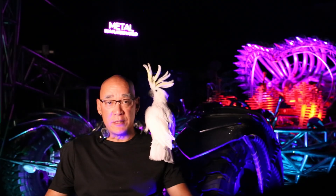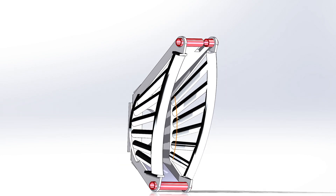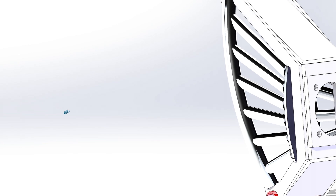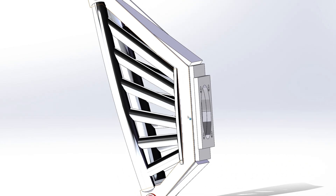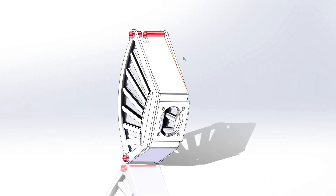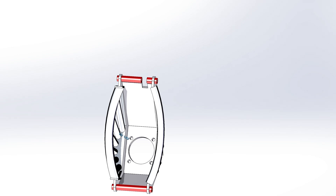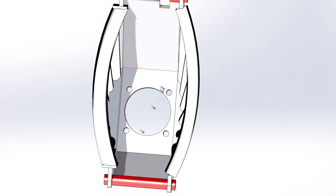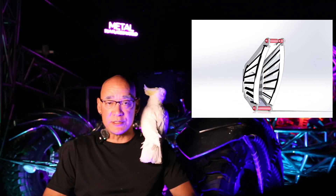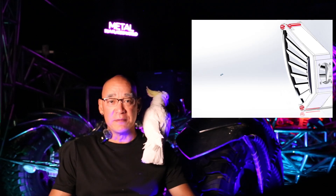We'll start with the spindle since it's pretty simple. Looking at this CAD drawing, you can see there's not that much to it. If we were making something that needed to be fabricated very quickly and not look sculptural, you could just make a little Kleenex box style spindle with the bolt pattern of the hub and attachments to the wishbones for the independent rear suspension. But because this is sculptural, we wanted to make it more aesthetically pleasing. So it's made of one water jet part that the hub bolts to, and the rest is custom bent stainless steel tubing that's welded up.